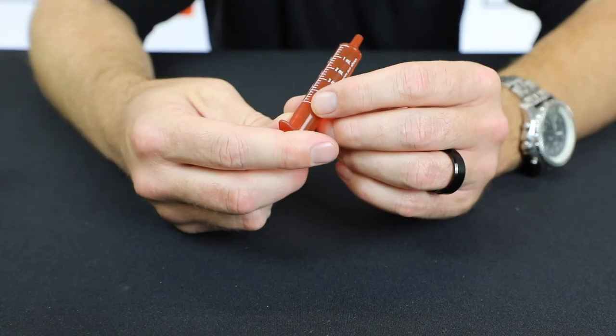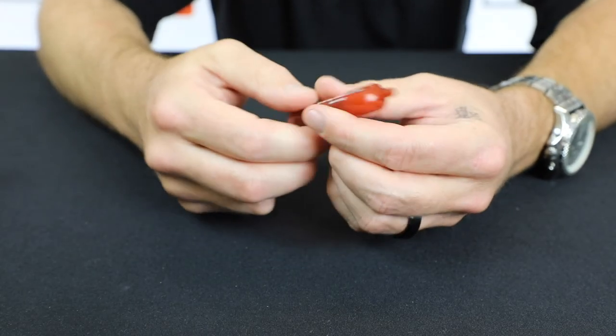We're doing quite a few eight-up projects right now where we're filling multiple vials at a time as they're coming down the assembly line. Some have a real small end you're shooting into, some have a larger funnel type — that's all going to play into the different nozzles and tubing that we'll use in order to shoot it in and not make a mess.